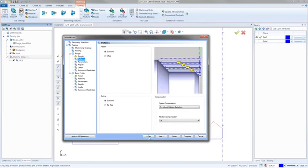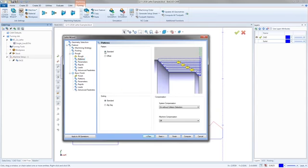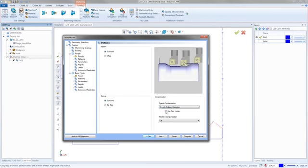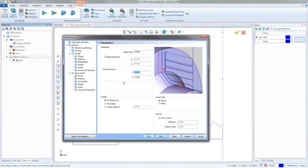Tool parameters have changed. I don't know what changed about that, but all right. Yeah, go ahead and change it for all of them. All right, so right here's our pattern. We got a standard cut and a standard sort. And then I'm going to just do the on with collision detection using the tool holder. You can see that this is going to start getting really, really repetitive very shortly. There's our depth of cut. I'll go 50 thousandths. This is what we're leaving for the finish pass.